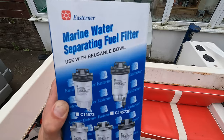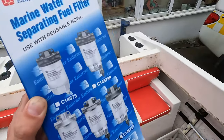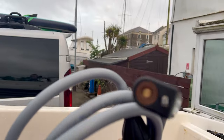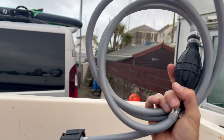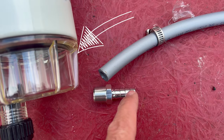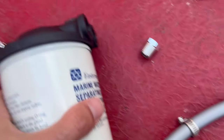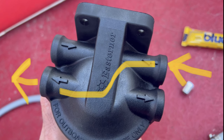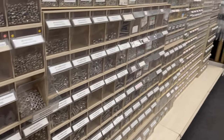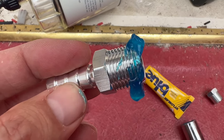I went for the Easterner Marine water-separating fuel filter — the model number says it replaces Mercury but they're universal, suitable for any petrol outboard. I also bought new Quicksilver eight-foot Mariner Mercury fuel line with new primer bulbs, which made sense to start fresh. I had to cut the line because I'm fitting the water separating fuel filter. You need to put a fuel-resistant gasket on it — it goes in one side and out the other across the filter. Quick trip to the shop for some stainless steel bolts, as none came in the pack.